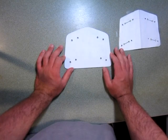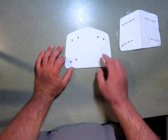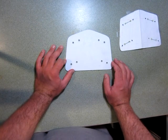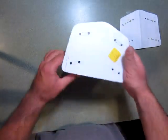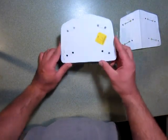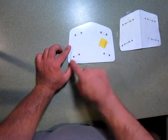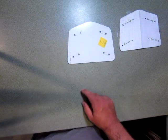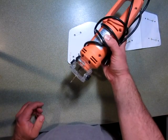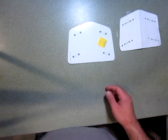Here we are so far — I've got it cut out and profiled, and the holes drilled. These are quarter inch holes; if need be I can make them larger using another drill bit or a hand file. I've already connected them with pencil lines between each of the holes, one on each side. I'm going to use my cutout tool to knock out most of that material, and then flush everything up with a wood rasp and hand file.